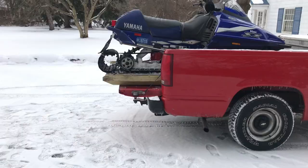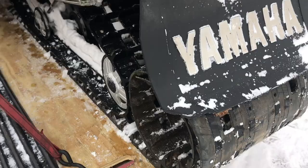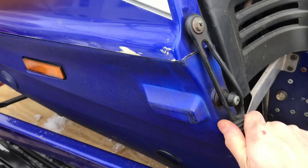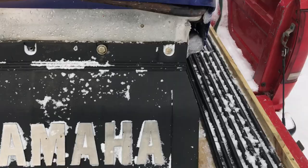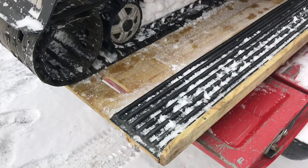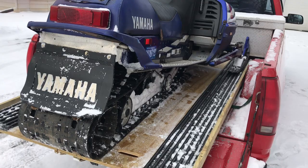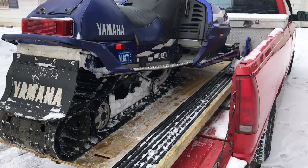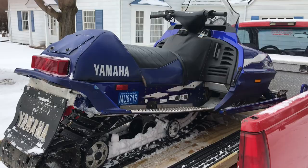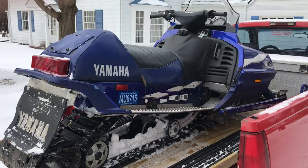As simple as that. You just roll the dragon tail up and bungee cord it aside, then hook a strap up to the pallet so it won't slide back. I still need to wrap a strap around the machine, but this is a super simple homemade sled deck — two or three hours to make, a hundred bucks, and it beats dragging a trailer. To unload, just reverse the process. This sled has no reverse so I tip it back and pull it off old school, but if you had reverse you'd just back right off. Anyway, let me know what you guys think — thanks for watching.